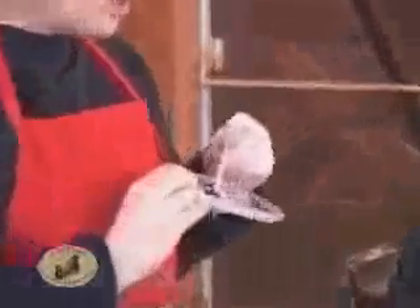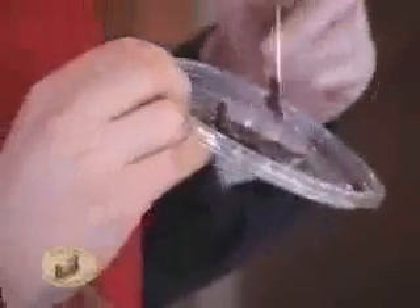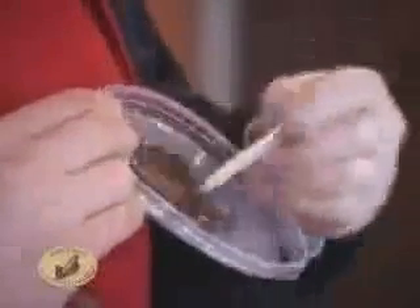Just a little bit of powder right on the wax, give it a stir. What I want you to see — and I want you all to do this — is how easy this is to blend and mix, and why that is, is because of the particle size of this earth pigment. Within a minute it's blended and you can now make any custom color you like. You can mix two or three of these pigments. As long as you have a neutral wax — a wax that had no pigment in it originally — you can pigment it yourself.